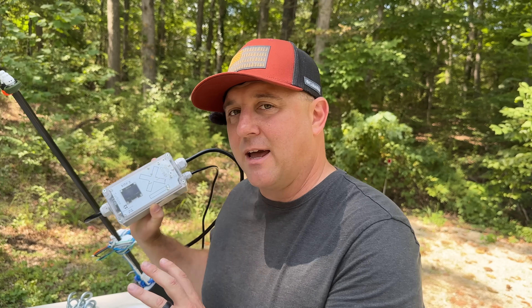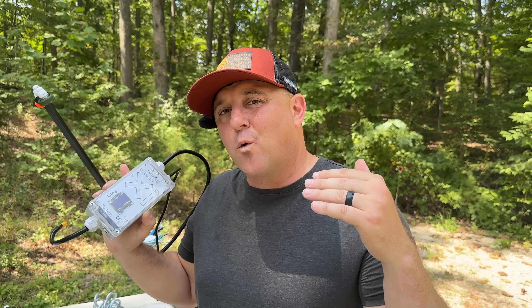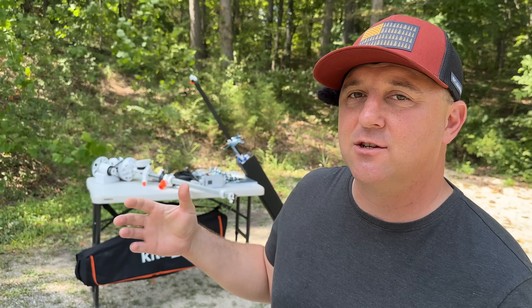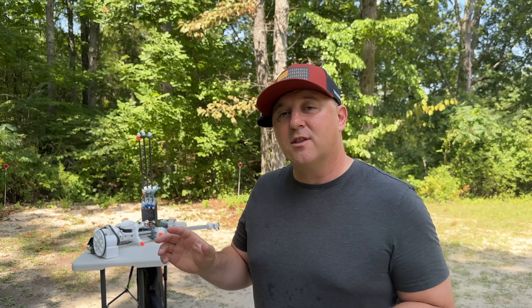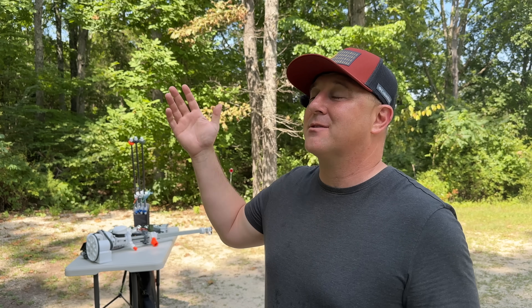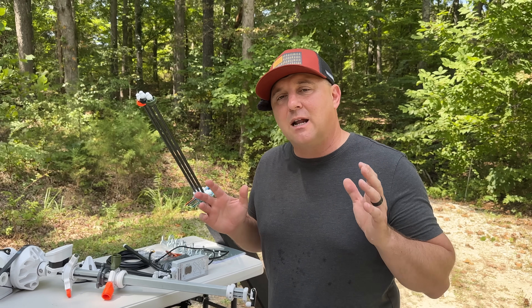The system is lightweight, and if you have it set up in a location with at least 12 to 13 miles per hour of steady-state winds, you can get up to about 4,800 watt-hours or 4.8 kilowatt-hours per day. My location is relatively isolated by woods, though I do have an open field behind me. The prevailing winds here are only around five miles per hour and I'm surrounded by trees, so let me get it set up and see what output I can get.